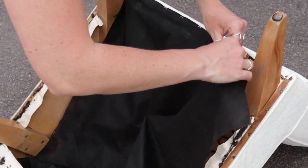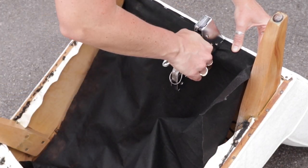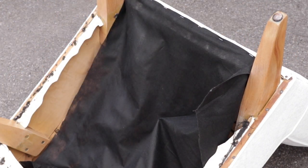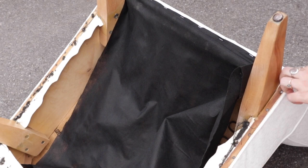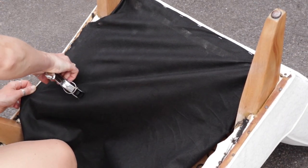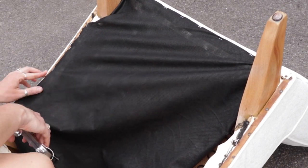I allowed the paint to dry overnight before I flipped it over and sealed the legs with polyurethane. I love the natural wood tone so I did two coats of polyurethane with some sanding in between. For the bottom, I just replaced the fabric — this is actually the landscape fabric you can get at the garden center to put down so weeds don't come up through your garden beds. It's basically the same material, really inexpensive, and you just staple it into place.